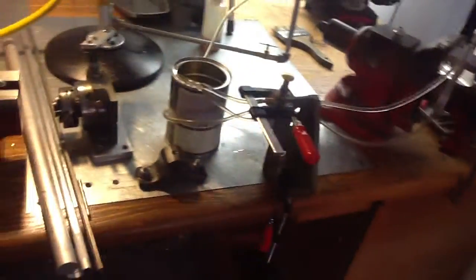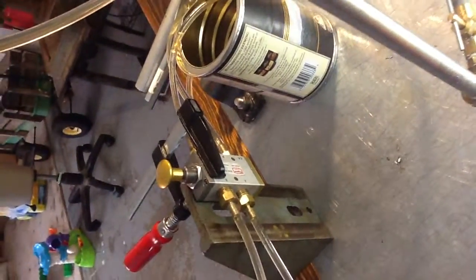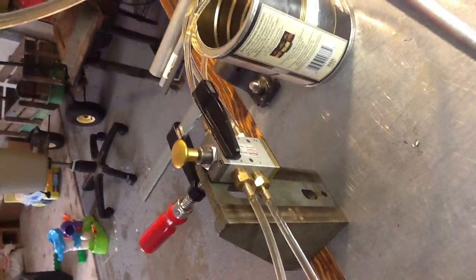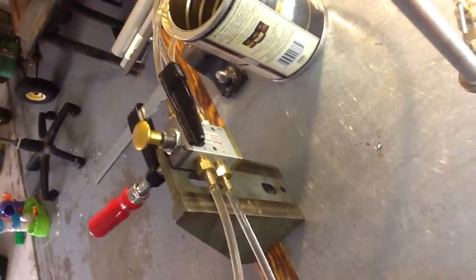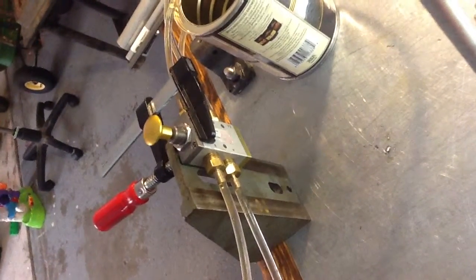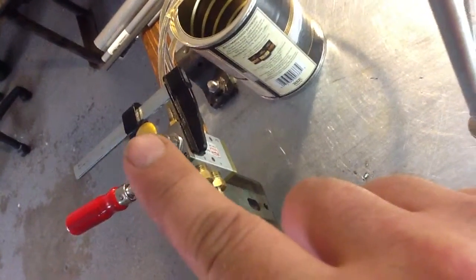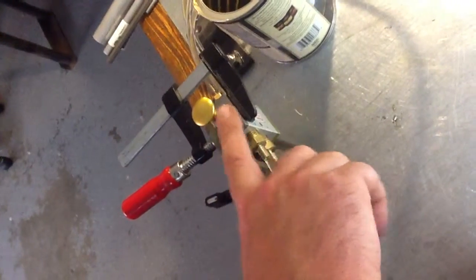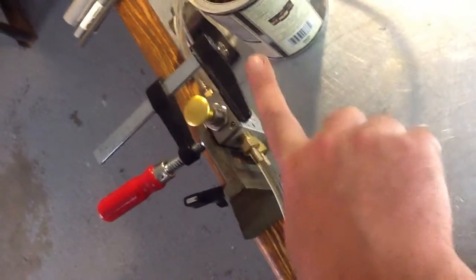So the valve — I didn't make this, I'm not that good yet — but this is a nice little valve that I purchased from a company called Clippard that makes all kinds of stuff like this. This is a really nice piece, wasn't too expensive, ordered it on their website. I believe they called it a five-way directional valve. So it's got three positions on it on the button there — up, middle, and down — which will either make fluid go this way, that way, or the other way. There are two sets of ports, and for each pair, depending on how you position the valve, the fluid direction changes. Which lets us pressurize the double-acting cylinder. So you can see there are two ports on it — this is a double-acting cylinder. And these are the fittings that are machined out of that stainless steel stock.